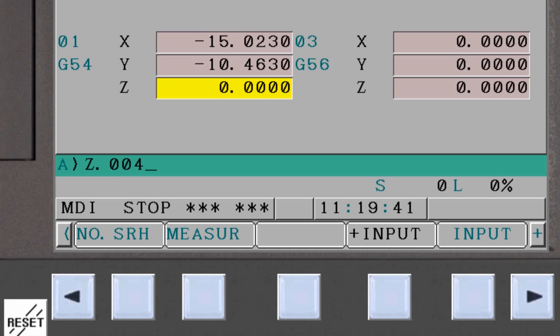Enter the thickness of the paper in the key input buffer — say four thousandths of an inch, or 0.004. If it is an unfinished blank, the ideal zero point is a short distance below the measured work surface to allow for a facing pass. In this case, enter the depth of cut of the facing path, say fifty thousandths, or 0.05. Now press the Measure soft key. All workpiece coordinate system offsets have now been set.